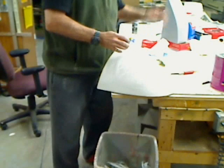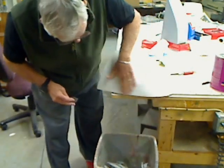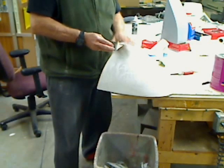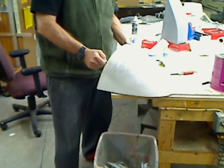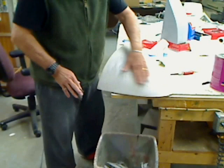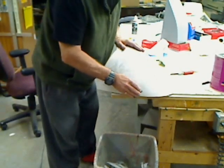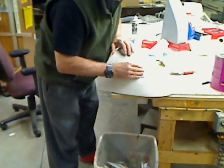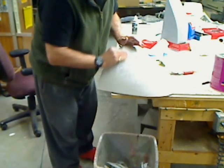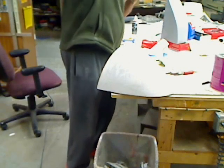I'm going to sand off the edges and pull off any excess. Now, if you're concerned about the grit on your paper — one thing to know is you can actually get a plug too smooth so that when you vacuum form it, the air isn't allowed to flow out and you don't get good adherence to the curve because the air can't get out. You need those little channels to suck that air out. 150-grit is not that rough, but I will sometimes touch it at 220 after the 150. I'll never go below 220 — I don't want to go down to 600 or 1200 like you would on the inside of a fiberglass mold, because you do need those little channels for the air to escape when you vacuum form it. Otherwise you're not going to get a good pull.